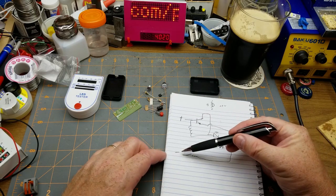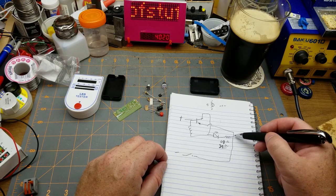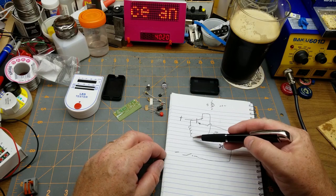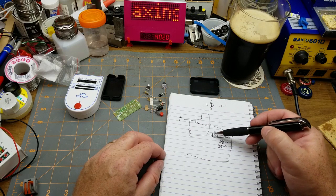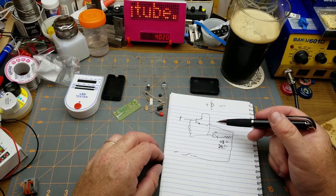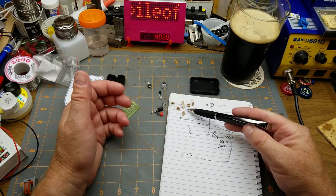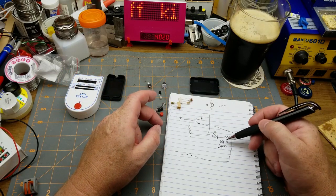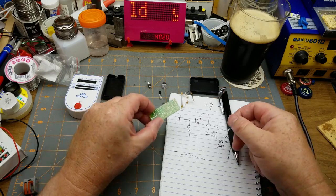Here's what I came up with: basically the negative side is all switching — it goes to the resistor in series with the diode, and ground also goes to the emitter, which makes sense. The collector and base are tied across the inductor, and when the inductor discharges it dumps its current out through the LED to the resistor. I noticed there are two different sets of resistors — two pairs of them. One measured at 46 ohms, probably 47 ohms standard, and the other is 22 ohms. I'm not sure why.